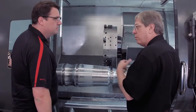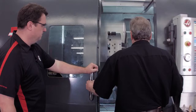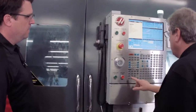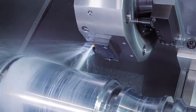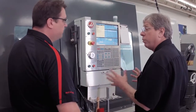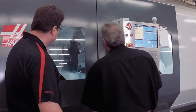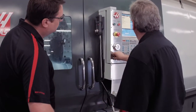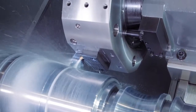Okay, let's get it back into the cut — close the door, start the spindle back up, start the coolant back up. You've got to remember to turn those back on. Right, you've got full control of the machine. Memory mode is going to get me back into jog return, which is flashing on the screen — that lets me know I'm ready to go back. Cycle start returns the tool right back to where I stopped, and then one more press to continue the motion.